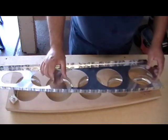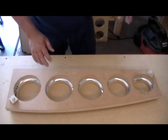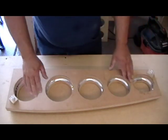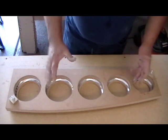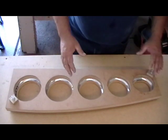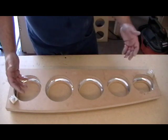That's what I've been working on for the last several days. I've been quite frustrated because after I flange the holes, when I take the rib out of the form, the rib is just completely tweaked in every direction imaginable, and obviously it's not going to be suitable for building a straight wing.